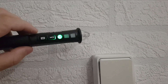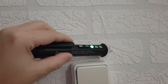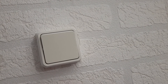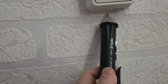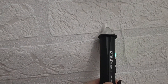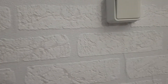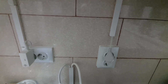If I turn the sensitivity down, it will not be as sensitive and it will not pick it up at all. It detects it only when it's really, really close. So for walls, I advise you to press the sensitive button so you can find the live circuits inside your wall. Here we also have some cables which we can test with this device.